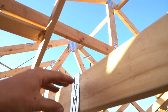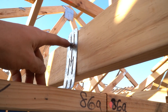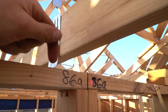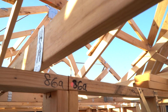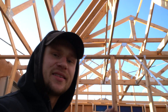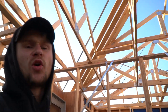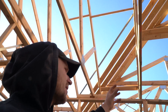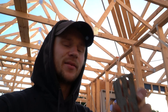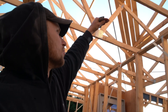When this roof is loaded with weight, this truss is expected to sag down very slightly, and since we've got these slots where those nails are, this truss should be able to move down and the L bracket is still going to be doing its purpose in holding the wall and the roof together. If we didn't have slots and we just nailed through, or if we put a bit of timber and shot into the truss and wall, it could cause problems — probably a squeak once the weight's put onto the roof. Basically, the reason why these have slots is so that we can attach internal walls to the roof and for the roof to still be able to move up and down if need be, without influencing the wall.